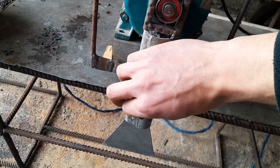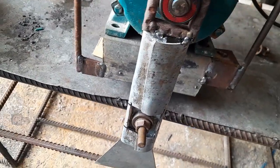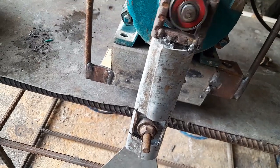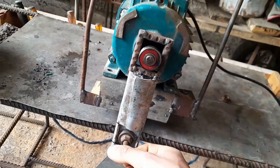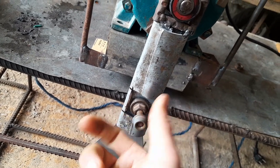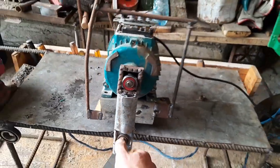The knife is connected to the shaft directly — these bearings serve as spacers. Because the knife is oscillating, we need spacers; nuts would lock it in place and we don't want that. I use dual nuts here to lock them into position without applying too much force on the knife, allowing it to move freely.